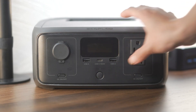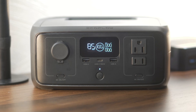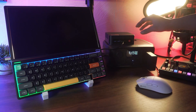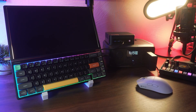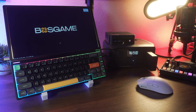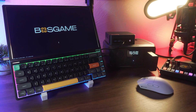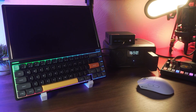Finally, I wanted to see what the numbers look like when the station is fully recharged. At 100% battery, the EcoFlow River 3 can idle up to 85 hours. Since I mainly plan to use this to power a portable workstation with my full mini PC setup, I was able to get between 5 to 9 hours of runtime — 9 hours with a consistent 20W draw, and around 5 hours when pushing 50W. While fully functional, I think I'm probably just better off using a laptop for the sake of convenience.